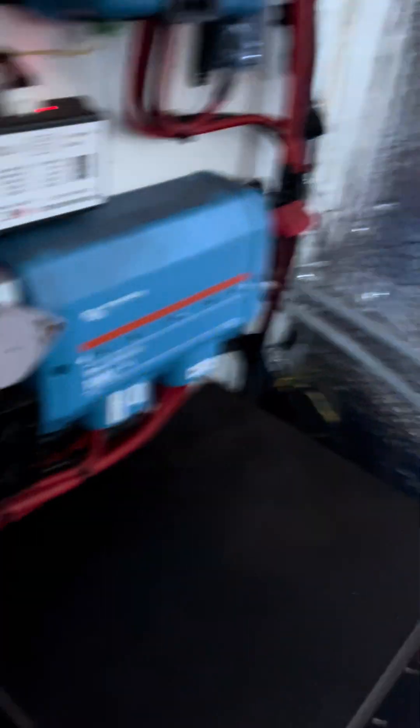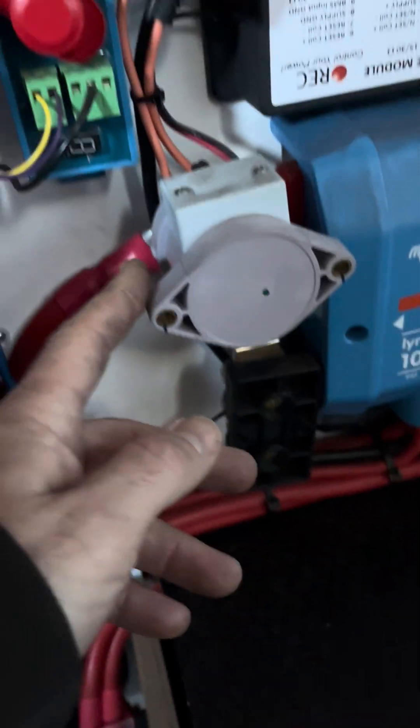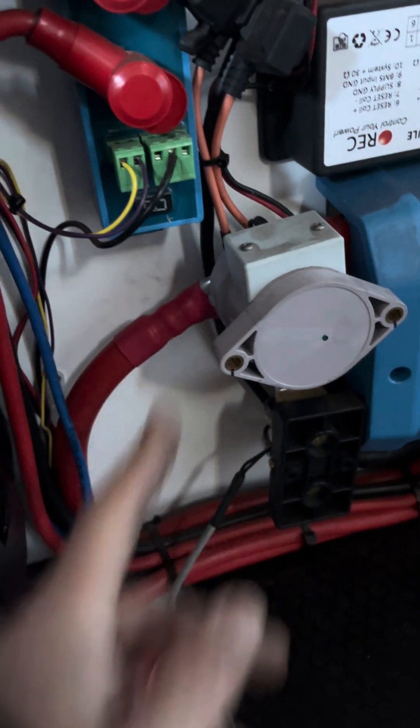It's really important — well, you have to use a battery management system, a BMS, to look after the cells in terms of not overcharging and not undercharging, and looking at temperature, so there's no charging below certain temperatures. This BMS is really well made. It's made by a company in Slovenia. It has its own shunt and contactor — a 500 amp contactor and shunt.